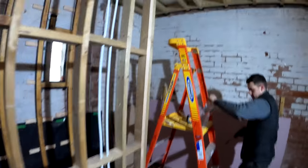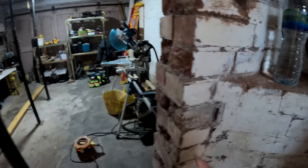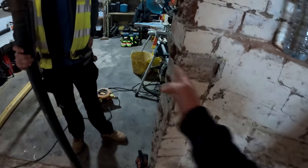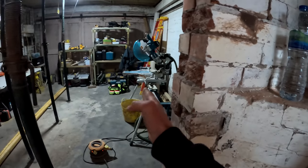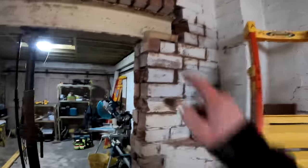The plumbers are busy getting all their first fix in. We've got a cage in there for our wall hung toilet. Joe is just currently propping this steel up, because what we're going to do is basically remove the broken bricks out of this and extend this pillar out slightly, because we're putting a sliding door which is going to go across this opening here. We need to make sure we've got something to fix our pocket door to, so we're going to be bringing this out to around here - making preparations in this wall for new bricks and to build this out. Joe's getting that pinched up now and getting this all stitched and drilled out. That's the update for the morning, let's crack on and do some work.